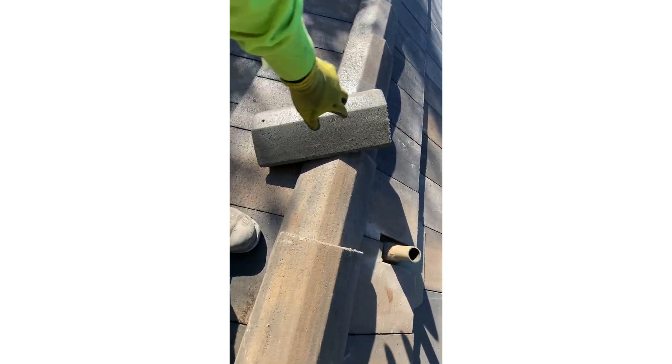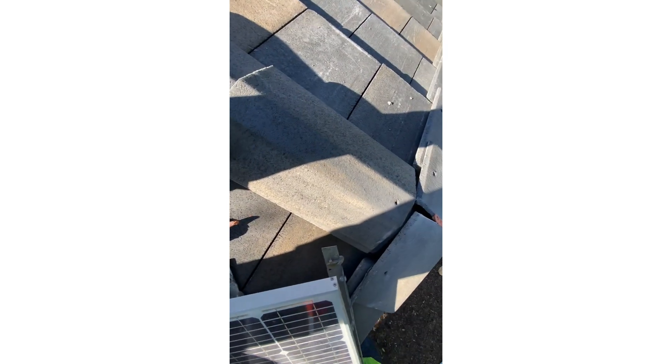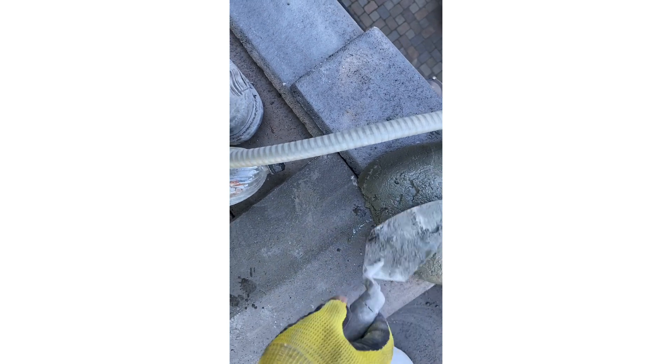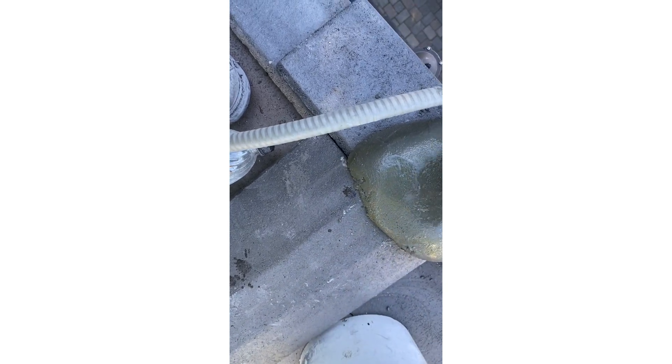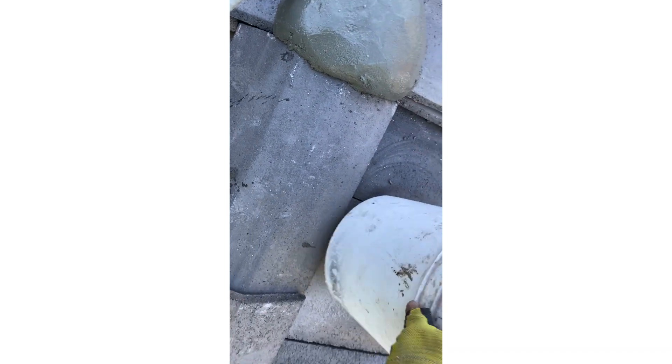You really have to think about the underlayment underneath the tiles, because that's the one that's going to hold the water when you have a leak. If you have a broken tile you're always going to have broken tiles here and there, no matter how good you are. I don't say I'm the best roofer — I just care for what I do and try to do my best. Here's another video of the mortar cap: I put a little bit of water on top and make it smooth — this is how it looks.